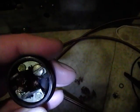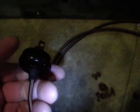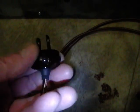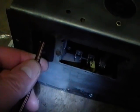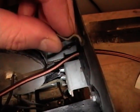That worked out fairly well. I threaded the ends of the wires, fed it through, out of the screw terminals there, got my strain relief on the end, which fits inside that bakelite. I think that will stand up to a lot of flexing. Now as for the other end, it goes through this hole which also has a generous opening, so I'm going to look for some kind of grommet to help out with that. And then there's this clamp that goes on the other side and acts as kind of a strain relief — it will square down against the cord. I found a grommet that fit into this hole quite nicely, and that provides some cushion between the chassis and the line cord.